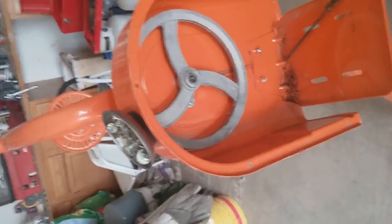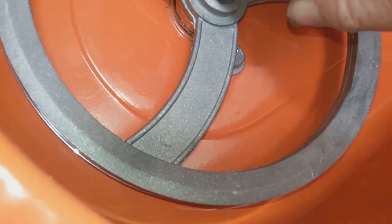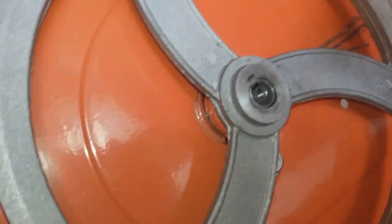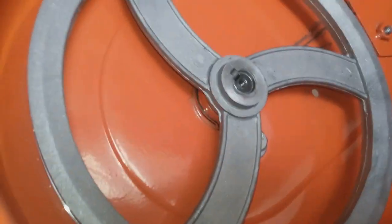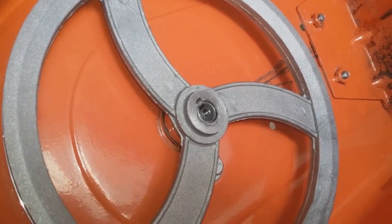About five days ago I took the cover off. What I found was that the bolt that holds this pulley on was really, really loose. And this little key that you see right here had actually fallen out and was just laying down here. So I got a rubber mallet, put it back in there, and torqued this bolt down real good, with red Permatex threadlock on it.